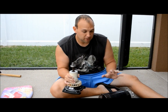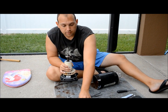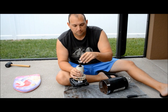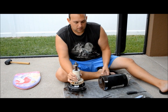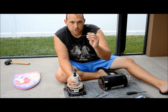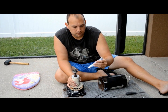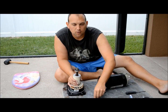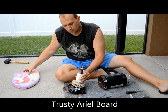Remember there was a little bearing load spring that sat on the back — that's going to rest right there when we put this whole thing together. Once I put everything on, I'm going to secure it with these four bolts, and I've got some Permatex anti-seize that I'm just going to lubricate all the threads with to hopefully prevent having to spend as much money in the future.